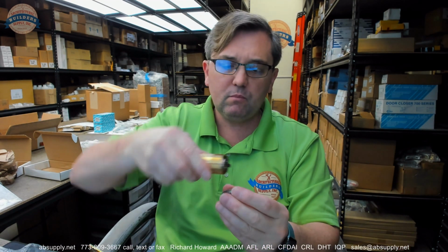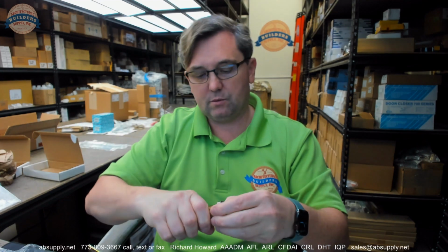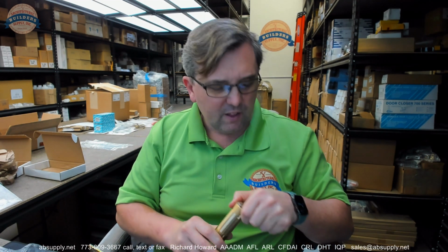It's a little bit longer. Oh, that's because they've got a couple of cylinder collars here. That makes sense. I don't have a problem with cylinder collars. They've actually included a spacing ring as well. So they have a cylinder collar that incorporates a spacing ring. That's getting us to about 3.5. If we were to use the thicker ring, I believe it's thicker, that should get us to 3 3/8. Yeah, right, spot on, 3 3/8. So this is going to be the ring that they'll use.